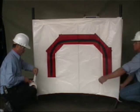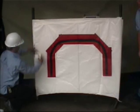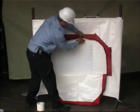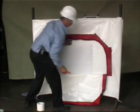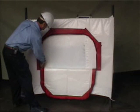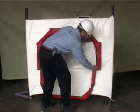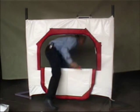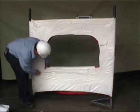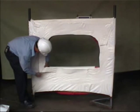It is also appropriate to use the shrink tape along any welded seams for jobs that are to be stored for extended periods of time or subject to transport. The tape is also very handy for patching any holes or protrusions, or to put on the external edges of sharp surfaces that could protrude through the plastic. It is appropriate to tape the doors and the windows from both sides of the tent.